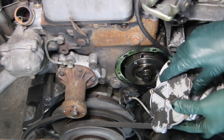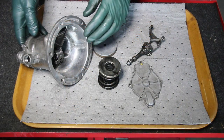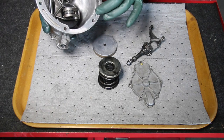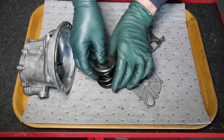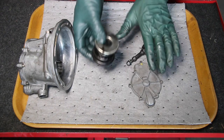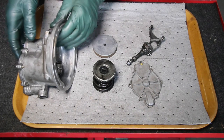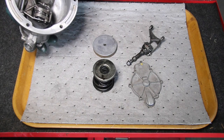Once you've inspected that, take it over to the bench — any further inspection will require that you take it all apart. I mentioned the importance of checking for any looseness in the bracket that holds the bearing. If this moves up and down, it means your springs have either weakened or are broken. This is really important. These parts are not available new or separately, but I do have a number of good used parts on my website that can help you overhaul your vacuum pump.